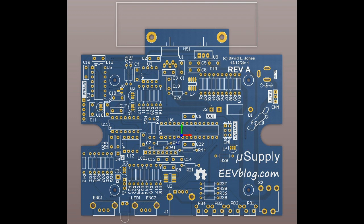And once again, I'll do a more detailed design rule check. If I do care about silkscreen over pads, I'll be checking for things like that. Electrical clearances, of course, is a big thing. Maybe component spacing clearances, but generally I know the size of components, or the silkscreen outline defines the size of the component. I'm not too concerned about components touching each other because I know exactly what I'm doing here.